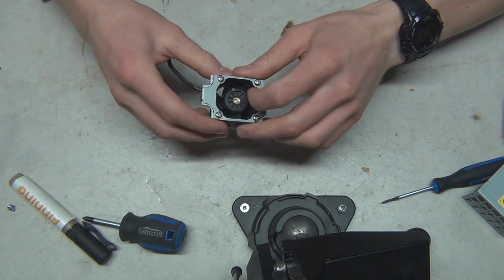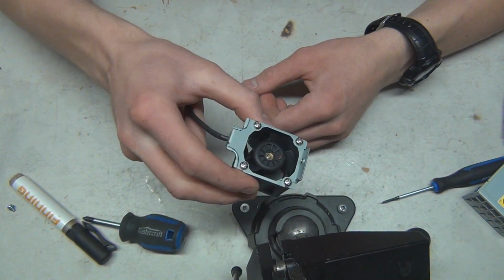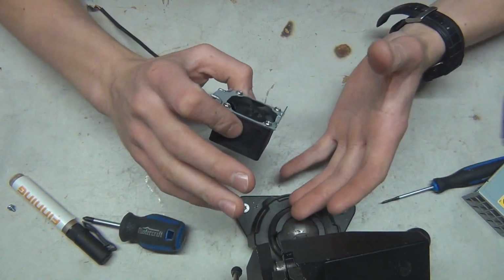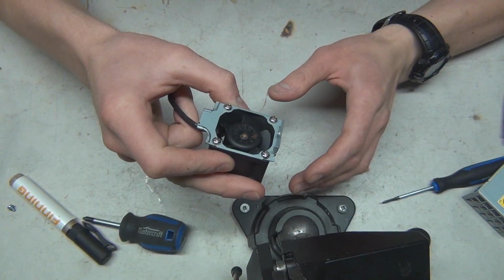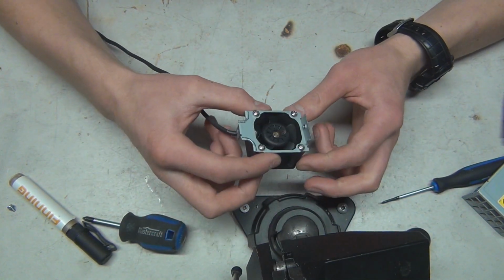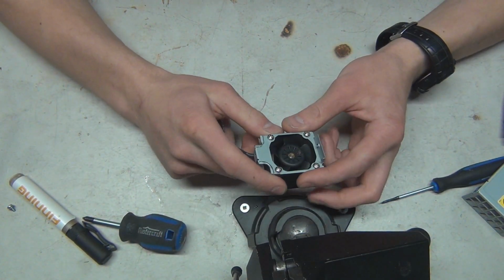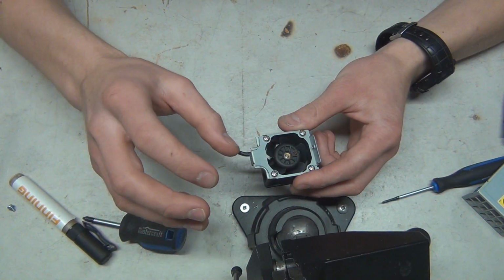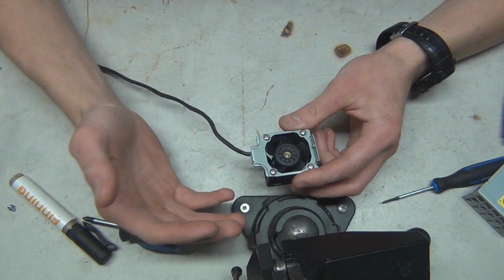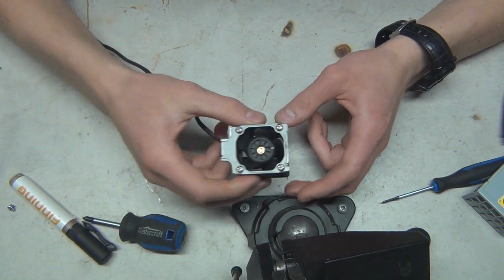It didn't spin as long. Now that is actually a good sign. That means that these bearings were dried out. It doesn't really make a lot of sense to people that don't really muck around with bearings a whole bunch. But if you actually have a grease packed bearing or an oil lubricated bearing, those will spin less long than a dry bearing, because the rotational resistance by itself is actually higher with a high viscosity fluid or oil, like as seen in this case right here, an oil.